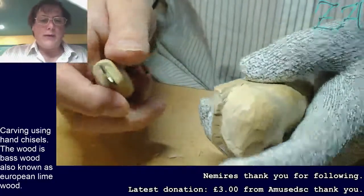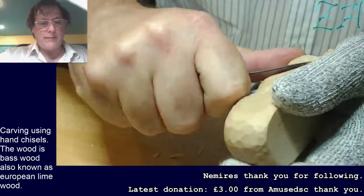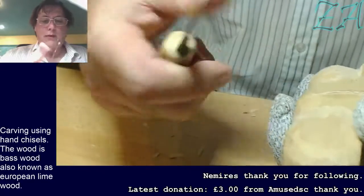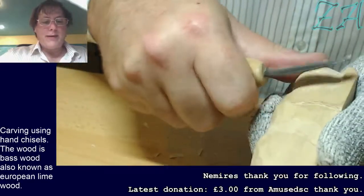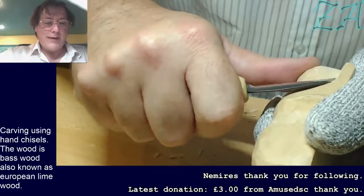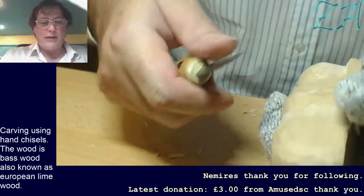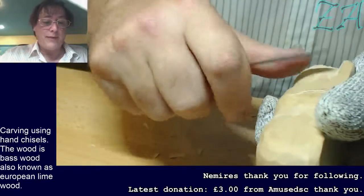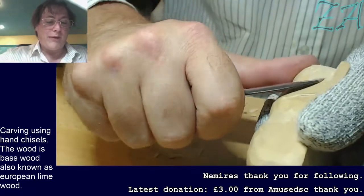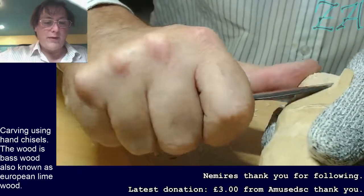Oops, it's going away from me. I'm trying to get in a particular space around here, but I haven't got a lot of room to support both the knife and act as an end stop, because I'm using that as the end stop. Well, as I come up here, as you can see, my end stop goes away, so I have to be a lot more careful. And I haven't got a position I can get into here. In fact, ideally, I should switch to the detail knife to do that, so that I've got the end stop for safety. Yes, I said I should.